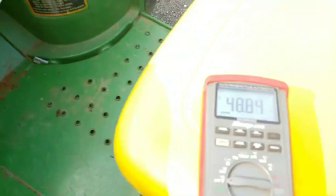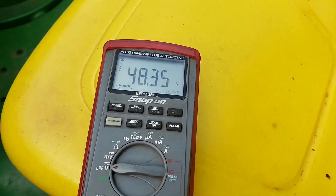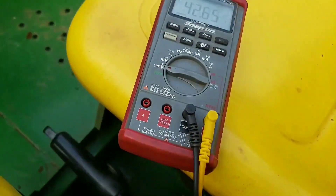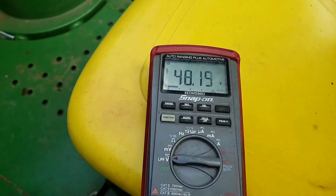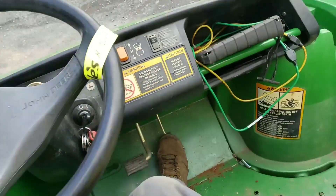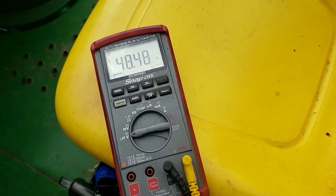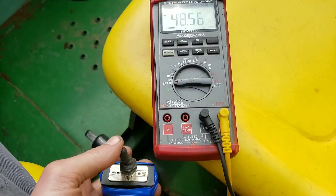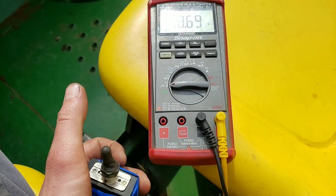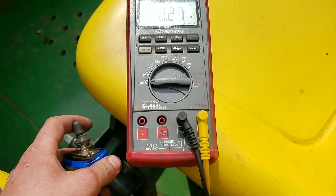We start slowing down — good start off and then it defaults to a crawl. Notice how we didn't lose hardly any battery voltage — it's still good, batteries aren't dropping way down, it's not a power supply issue. We switch this off — and there we go. We cycle power to the controller and all of a sudden we get a short spurt of full speed and then we're defaulted. So what does that mean? Well, one — we know our batteries are good. Two — and this is what I keep harping on — service information, knowing how it works: power off shuts power off to the controller, power on gives full current to the four outputs out of the motor controller, so that gives us full speed.